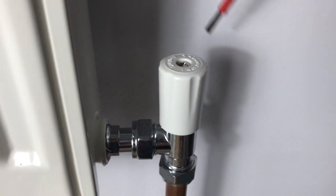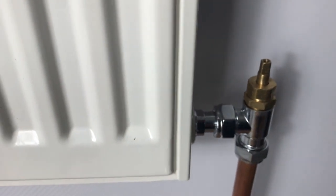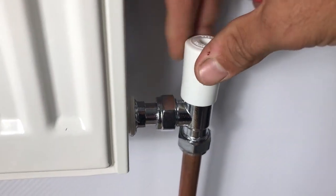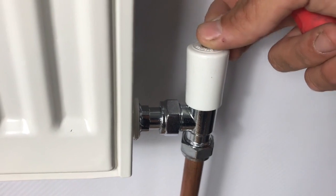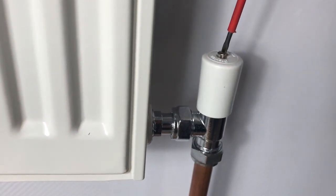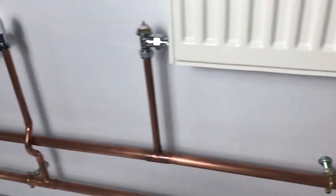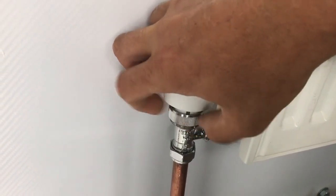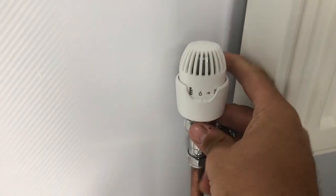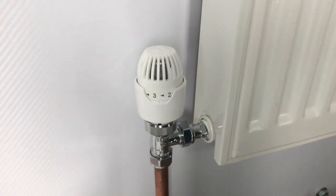Now the most important thing is to lock that setting in. We do that by removing the adjusting cap and replacing it with the locking cap — remove the center screw, the adjusting cap comes off, and the locking cap doesn't turn because the molding fits into one of the flats on the hex on top of the lock shield. Replace the center screw so the cap doesn't fall off. On the other side, install the sensing head at maximum, fitting it on the RT212 — it has six positions due to the hex nut — and set the required comfort setting.